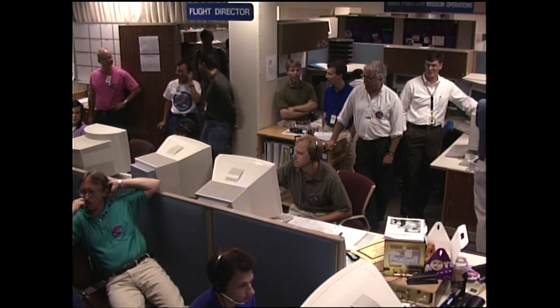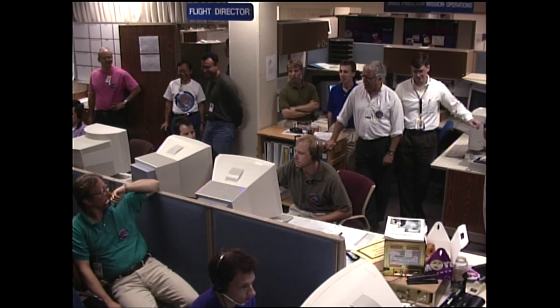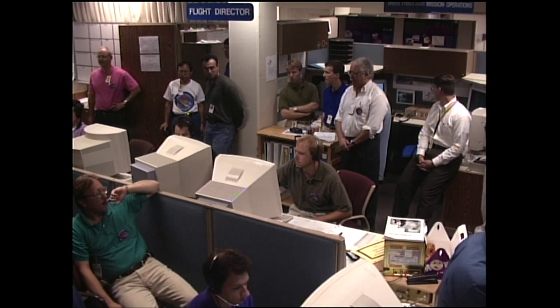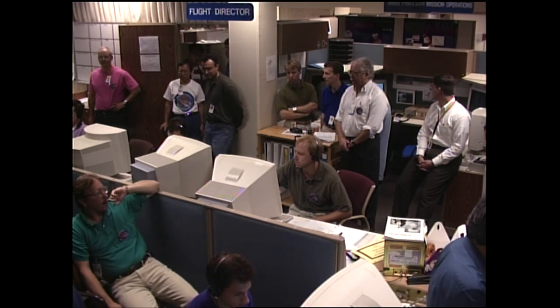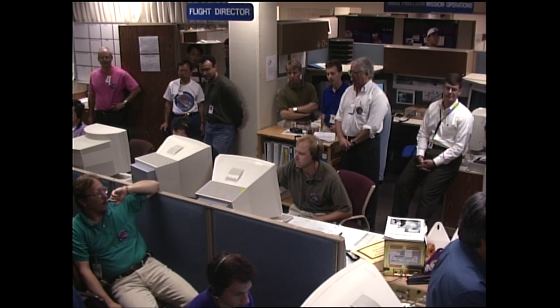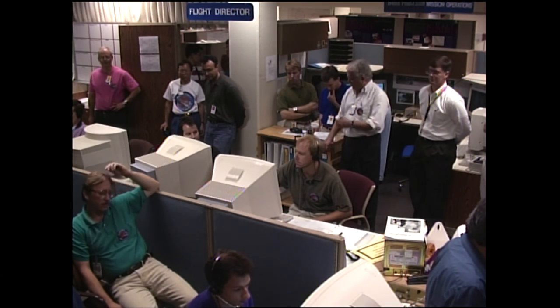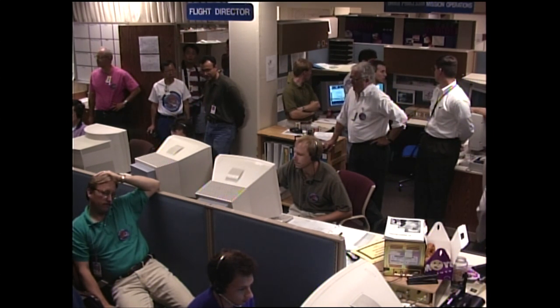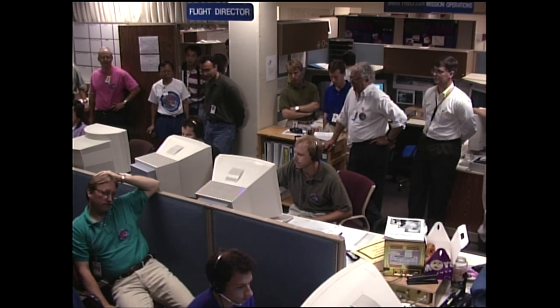Earth is now rising at our landing site in Ares Vallis. As those of you who have been listening have already heard, about an hour ago, we vented freon that has been circling around the vehicle for the past 7 months out into deep space. Because the lander and rover electronics are so well insulated from the cold of the Martian atmosphere, we had a challenge to keep the vehicle cool during the 7 month voyage to Mars. The solution we came up with was to pump liquid freon around the cool outer periphery of the circular cruise stage, then route this freon back inside through plumbing into the lander and past the rover.